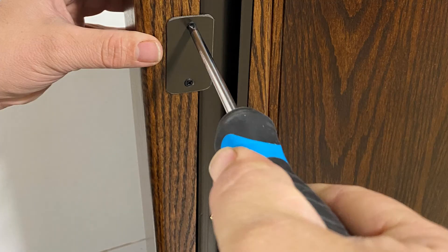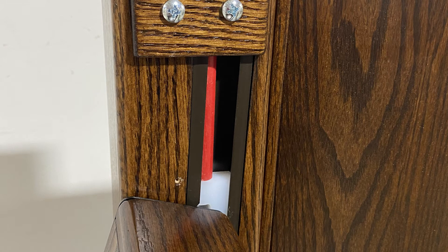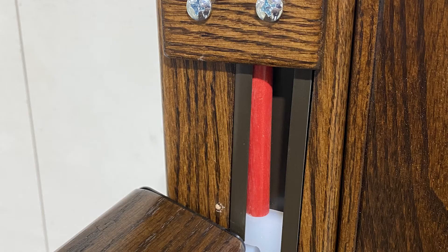The first thing you're going to want to do is open the door completely, and you'll see a plastic tab that needs to be removed as shown. Then you're going to close the door, and using the dowel spacer rod that has been provided, you're going to want to put it in between the plastic slide and the top of the spring housing. This will stop the door from closing completely.